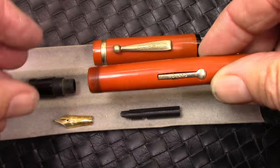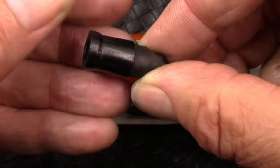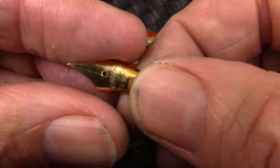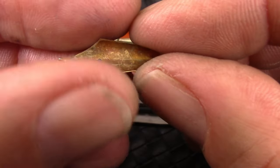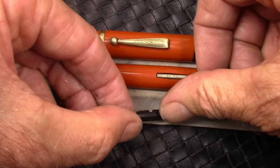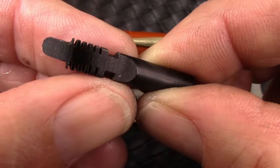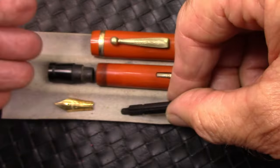I think the ebonite this pen is made from is quite sturdy. The section was easy to work with — basically just needed to get the ink off of it. I scraped all the leftover sack that had stuck to it. The nib looks nice and will be polished. Like a lot of these nibs, it wasn't polished on the reverse side — I'll clean that up a little bit more. The feed is also in good shape, nice deep channel, reminiscent of a Waterman spoon feed. Some fins — I think that'll provide a nice ink flow to the nib.